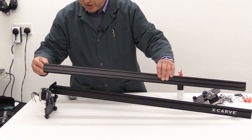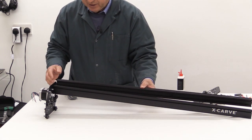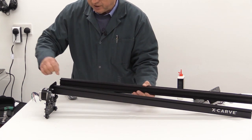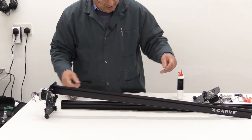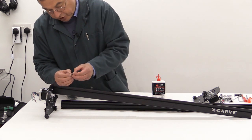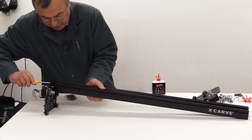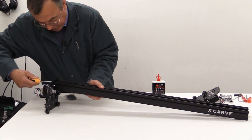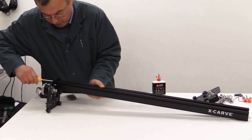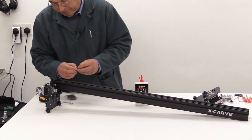In the instructions, we take a second piece of maker slide — this one has no logos on it — and attach it again to the left-hand Y-plate. This time the V-section is nearest to me, so the two V-sections are opposite each other: one on this profile and the other at the front on the first profile. The process is the same — a little oil on the thread — but this time we're going to use a washer because the holes it's going through are slotted. Push as you turn, and leave slightly loose before tightening so you can get the second screw in. Remember, the washer is needed because it's the slotted hole in the Y-plate.